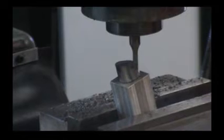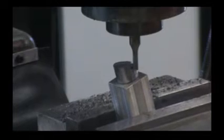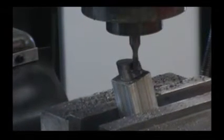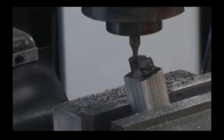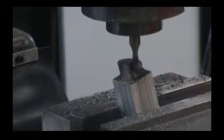Now I need to mill a step for my set screws to hold the high speed blank, and that'll be the same depth as the slot. Here I'm touching up and taking the finish passes on it. Here's a look at it, and we're ready now to put the tapped holes into the side of it.